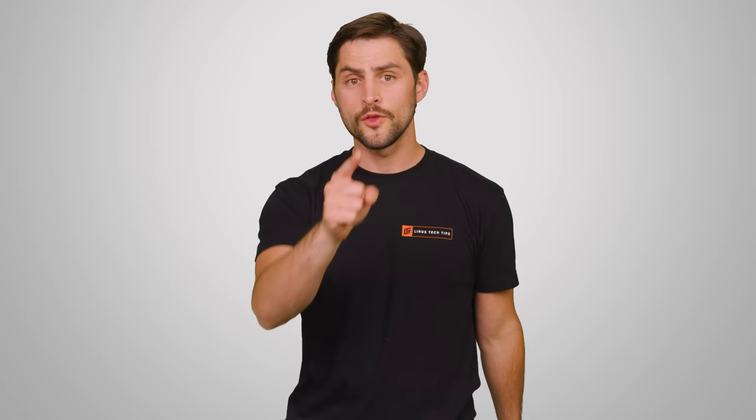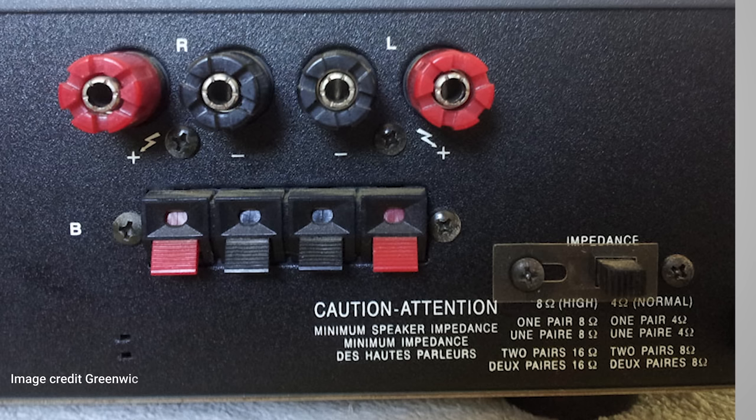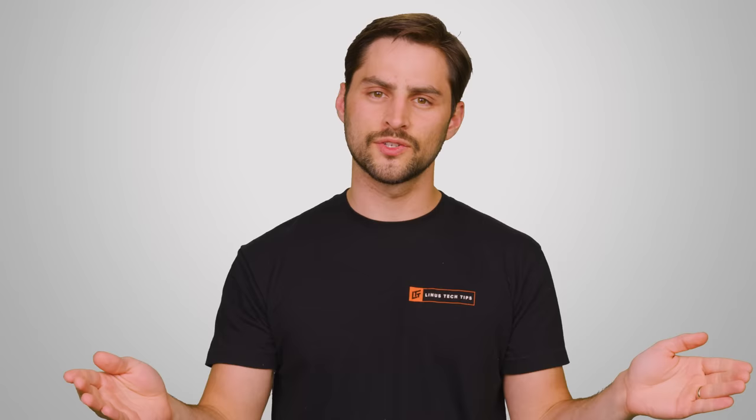But let's say you're using a more elaborate setup where you're buying components like speakers and amplifiers separately. Your best bet is to find a set of speakers that can produce the volume you want — often listed as the sound pressure level — and then choose an amplifier and power supply that can provide more than the listed power requirements of the speaker. Also be sure to check out the impedance rating of both your speakers and your amps and make sure they're matched up. Ratings are often given as a range, so as long as there's some overlap, you should be good to go.